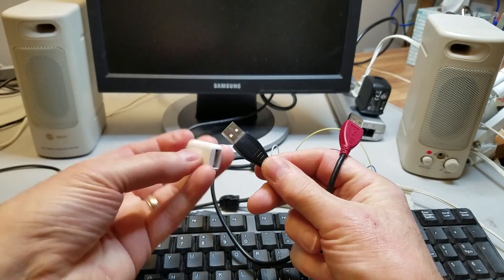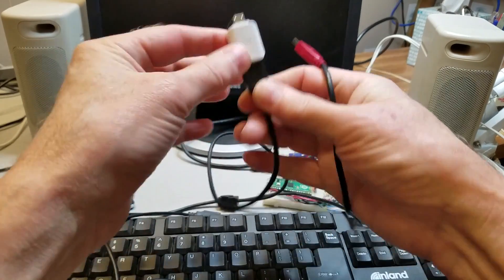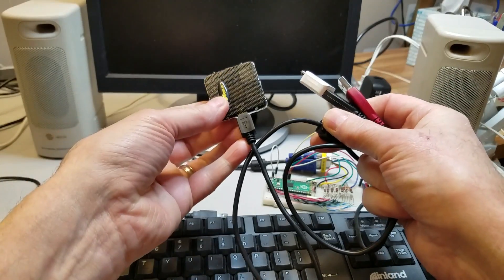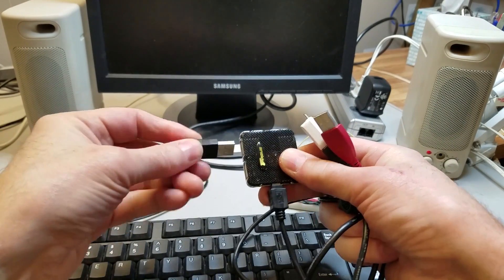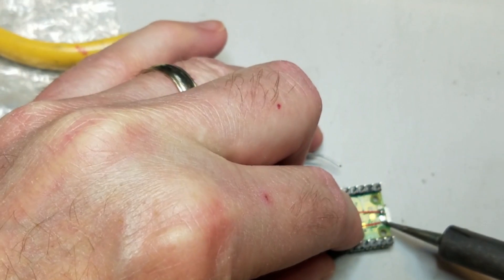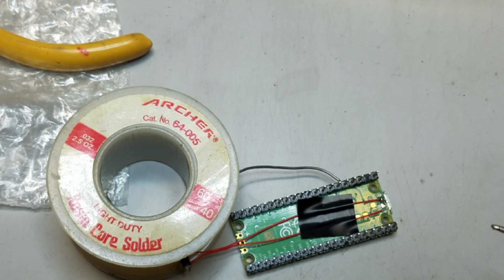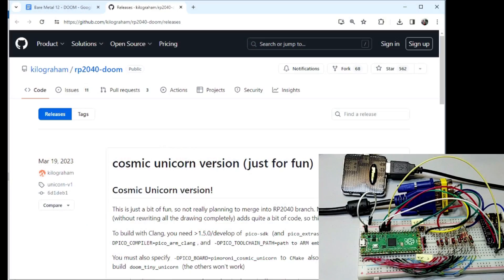This one came with my old cell phone, which had USB on-the-go capabilities. This allows me to plug the Pico into the upstream port of a powered USB hub and act as a limited host. I'll plug the keyboard into a downstream port on the hub. The powered hub will provide power for both the Pico and the keyboard. Before I insert the Pico into the breadboard, I added a couple of wires to test points 2 and 3. That will allow me to monitor the data positive and data minus lines of the USB network. With that, I should be ready to try Doom.